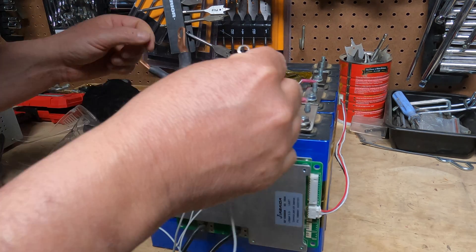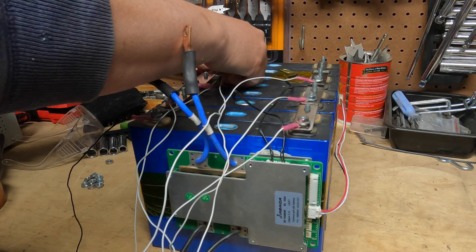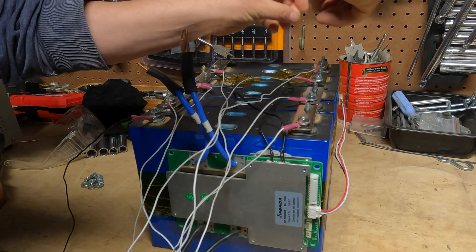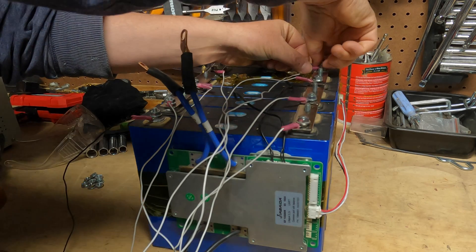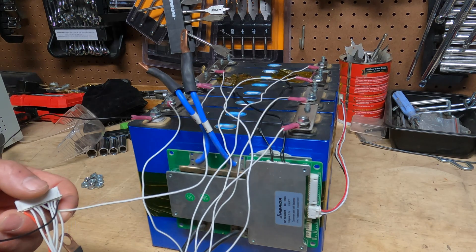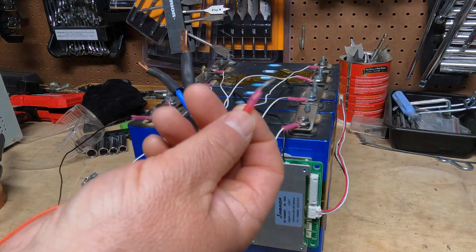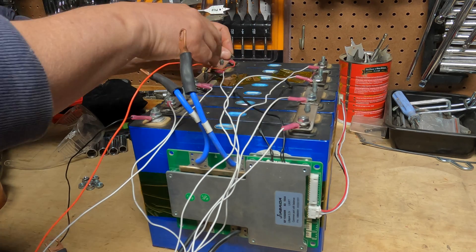This gets kind of boring because all we're doing is putting them on each one — feel free to fast forward. We're almost done. Then there's another one, and the final one is the red wire. Not all BMS wiring harnesses are like this — these are JBD harnesses. If you get a Daly they're all going to be red. I like JBD BMS's for several reasons and this is one of them. The red wire goes on your last positive, which is your main battery positive.